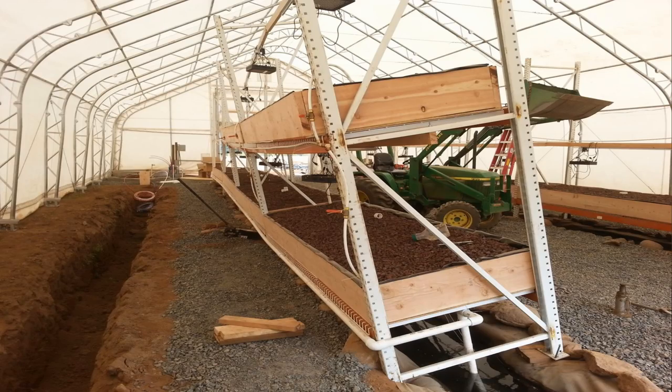I will say this, that on each of the pilings, I actually have about an almost 3-foot long piece of rebar that's actually whacked all the way down into the ground and bent over at the top so that if there was an earthquake or anything like that, it actually does help hold it in. I actually think that's why the failure that we had there wasn't as bad as it could have been, is because those things actually did grab hold and do what they're supposed to be doing. So there is safety items built in.